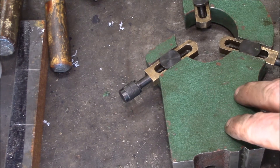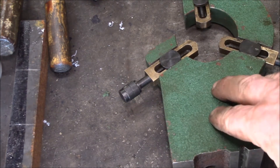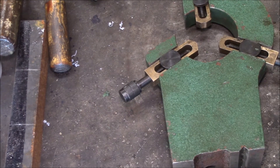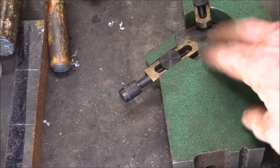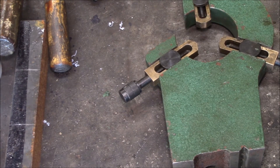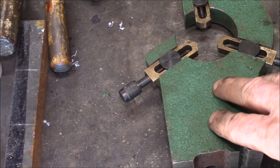That's some of the cleanup work you have to do on these Chinese lathes. It's a Grizzly G4000 — I've used this just a couple of times over the last 20 years but I've never cleaned it up. They always talk about how you need to do a little bit of cleanup work. Luckily the original paint had softened up so it was real easy to remove. They really shouldn't paint the inside of those slots — you can't have paint inside a precision fit groove. Anyway, that's how to clean up one of these steady rests to make it a little more easy to use.